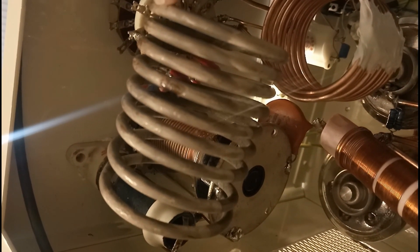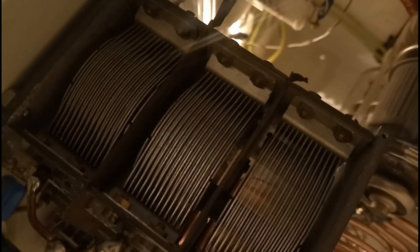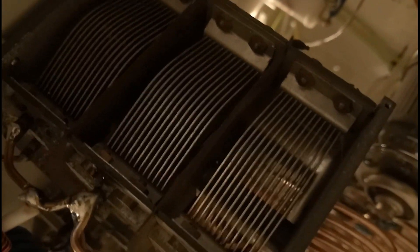You can see that the Plate capacitor is, as always with my amplifiers, a Russian military vacuum capacitor. And for the antenna capacitor, it is a classical air-spaced capacitor — not very spaced, in a matter of fact. So the amplifier will not tolerate huge SWR. Big SWR will not be tolerated, it will discharge. But as long as the antenna is 50 ohms, or it is correctly matched, there will be no problem.